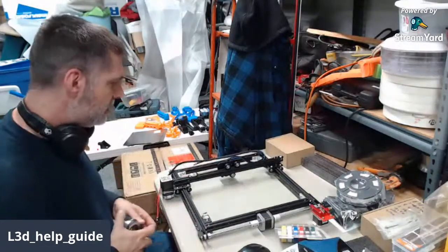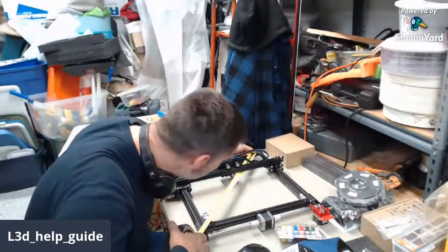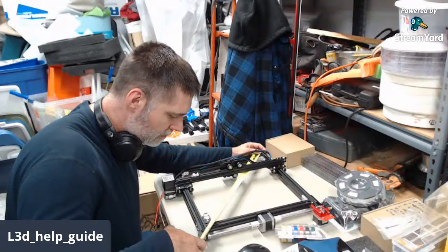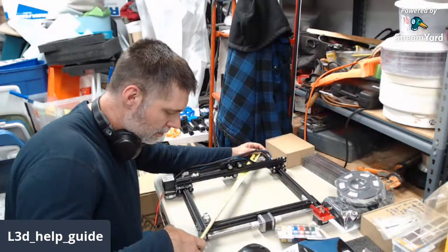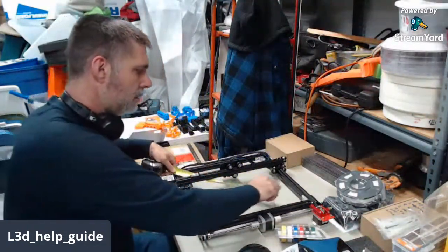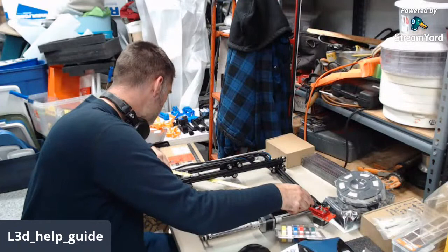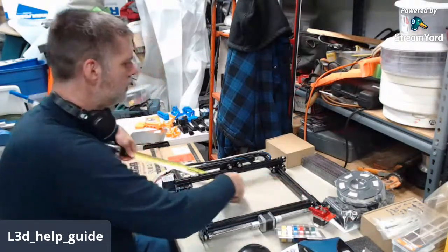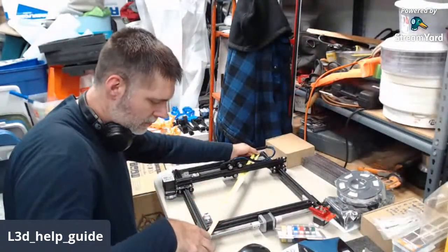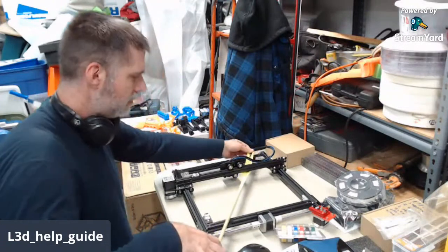Most likely, if anything got damaged, it would have been making this frame out of square. So we're going to do a cross corner check to see how square it is. That's 22 and just under 13/16. Get my eyes checked. 21 and 13/16.